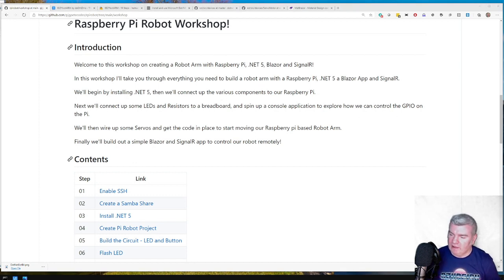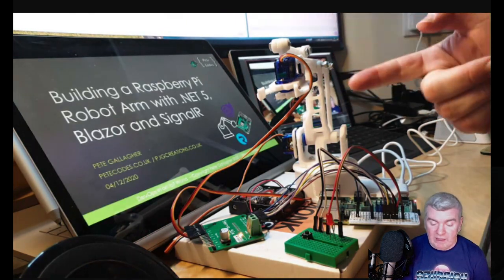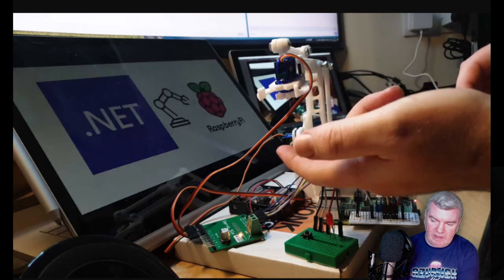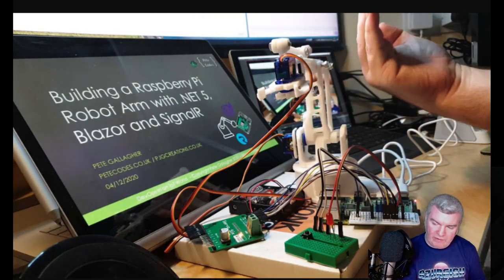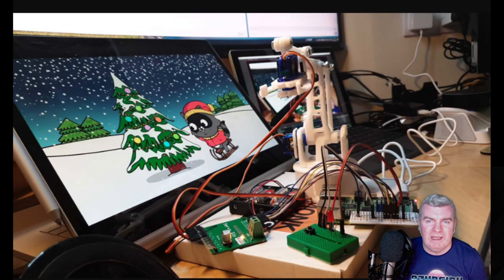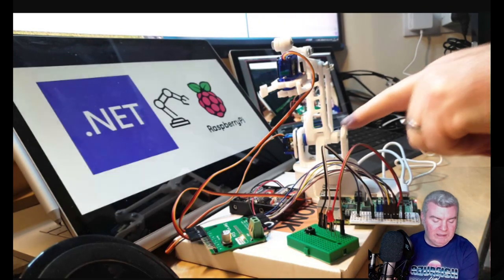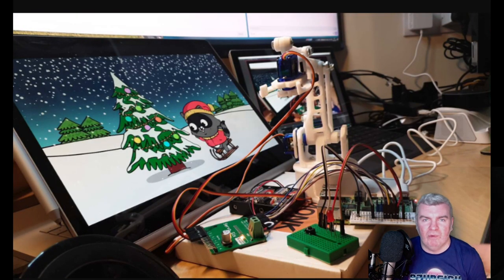Essentially what we're going to be doing is building the code to drive this — a 3D-printed robot arm. It's got three servos, but we're only going to be driving two of them today. There's a servo on the claw-action pincer and another servo that drives the arm forwards and backwards. The servos are being driven by a little driver board made by a company called Monk Makes — a cheap, affordable board. It saves you worrying about power — I've got batteries plugged into that board so you don't draw too much current out of the Pi.